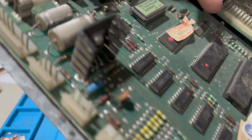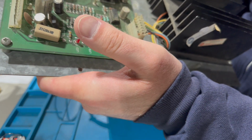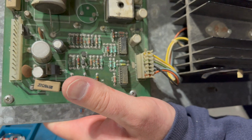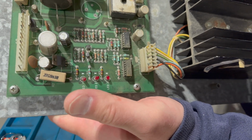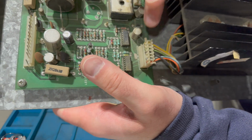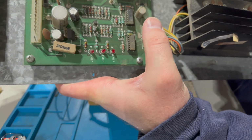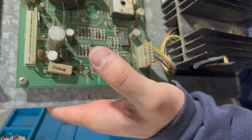There's a fuse missing on the soundboard. I see some other things that we're going to have to do. But yeah, what I wanted to do was rebuild this power supply PCB, install new headers, replace the caps, redo this IDC connector here with a trifurcon plug.